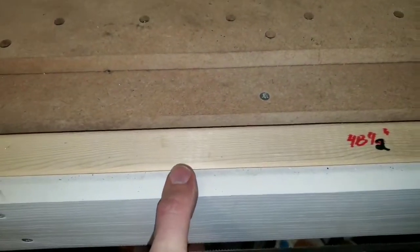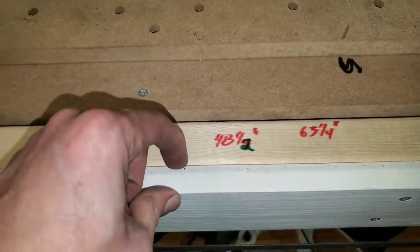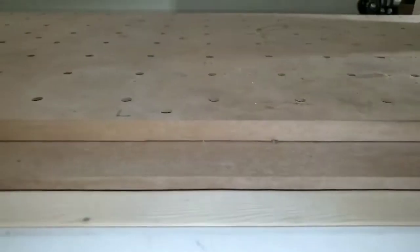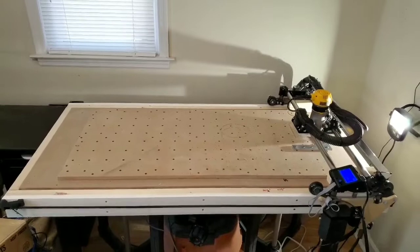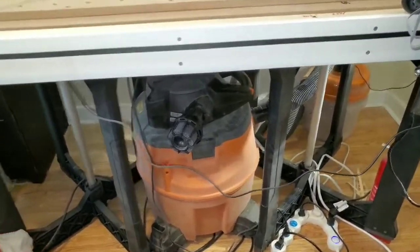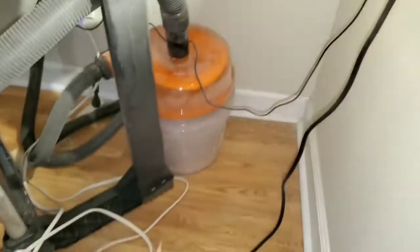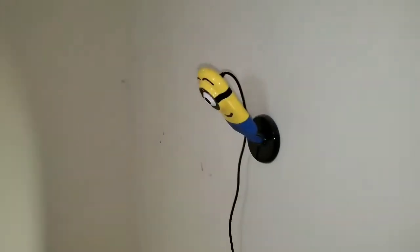I'm running a PVC board for the rails for the skate wheels to roll on — these won't ever wear down. I made the 2x4 frame just narrow enough to have those on either side, put together with a roofing nailer. It's 2x3s, there is a three-quarter inch piece of MDF sunk in as my spoil board with the nut inserts, and I milled those out. This is a 24x48 sitting on top of two Home Depot work stands. It's a large 6-horsepower vacuum with a diffuser on it, a dust topper from Home Depot, and you can see the dust and wood chips in the bottom. There's a work light and my camera to monitor the job.